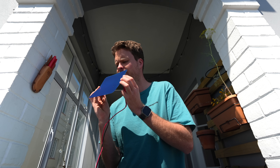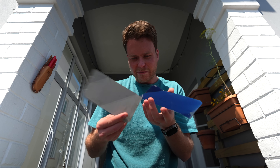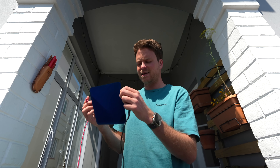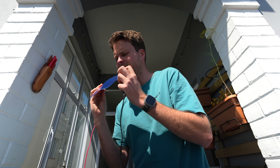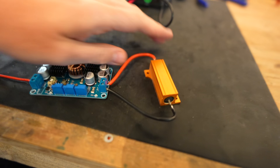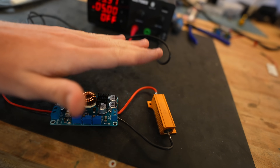I'm getting a reading — yep, I told you they were fragile. I've got another one, I'll try not to break this one too... I just broke that one as well. These things are ridiculous. I think it'll still get a reading though — we're getting 695 millivolts, so 0.69 volts. I want to get real world numbers of exactly how much power these panels are producing before I put any of them on the drone. I've got a 50-watt power resistor here which will dump the power generated by the panels and give me a good indication of how much power they generate in direct sunlight.